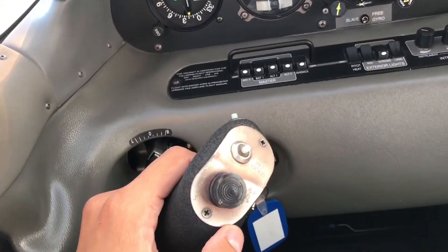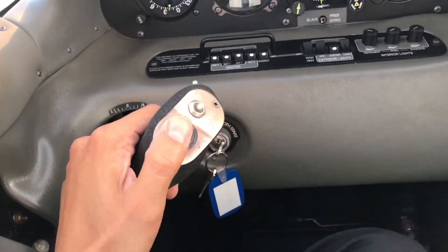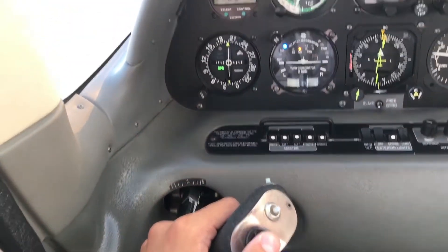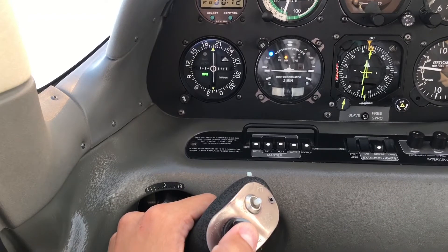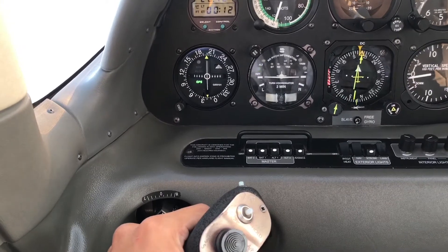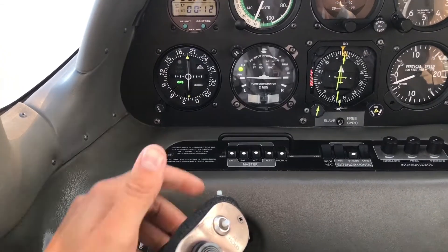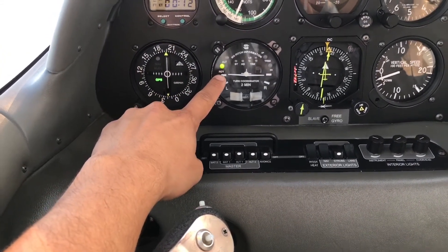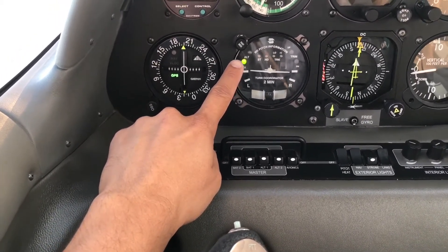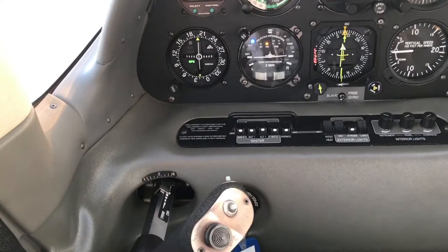The last control we have for the autopilot is the autopilot disconnect button, which is on the side stick trim control — left, right, down, up — and if I press on the middle, see how all the lights are gonna go off and the radio will flash. That's autopilot off. You will hear a tone and the autopilot is gonna disconnect. After some seconds it will return to the ready green light, which means you can engage the autopilot again. I'm gonna select the heading mode with GPSS and altitude hold again.